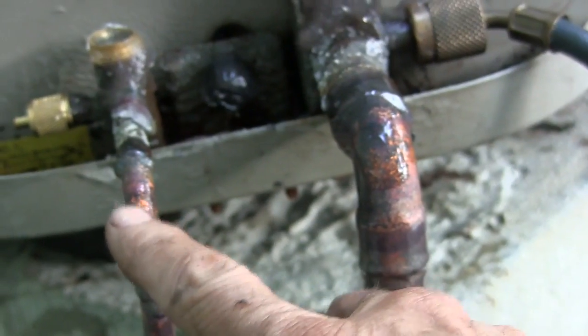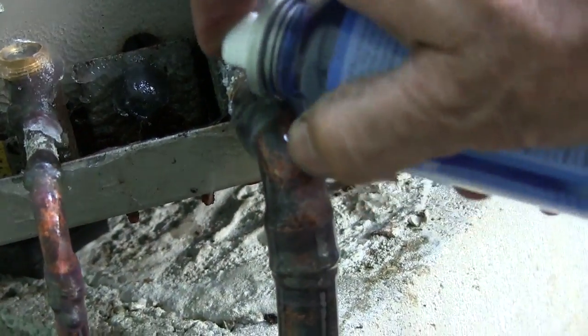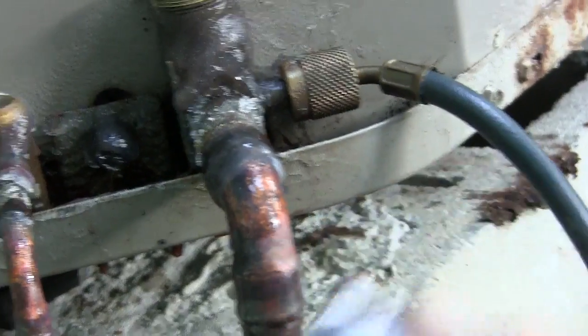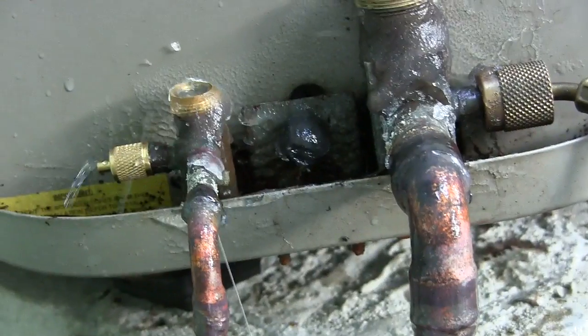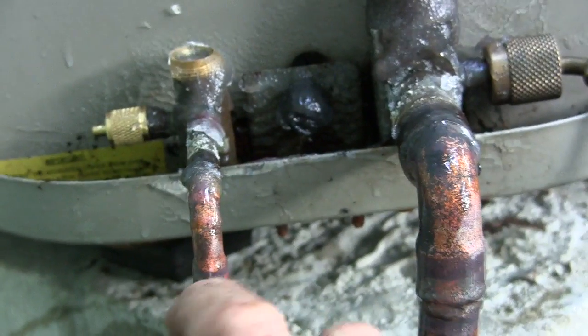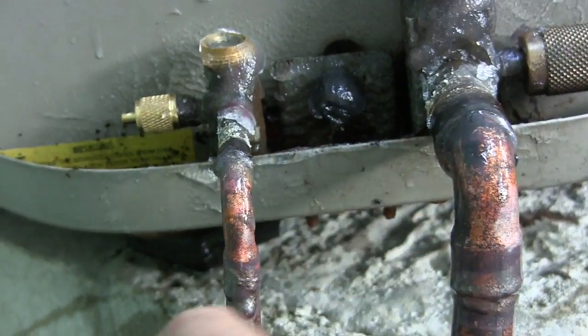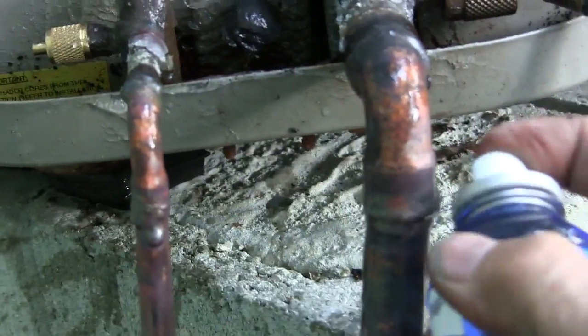Right now I've got this system under pressure with nitrogen and I want to see if I have a new leak. As you can see, I can squirt way up with this — this can will spray pretty high. So if you can't get to a joint that you are trying to detect a leak with, you do not have to keep the can in the upright position like this.